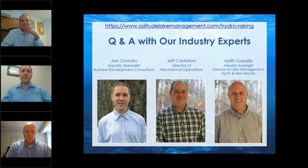So, I think the short answer is probably yes. I think there's a lot of variables. As much as I hate to give a wishy-washy answer, there are a lot of variables at play to really determine whether or not the use of the hydro-rake could have undesirable impacts to the system. So, is the pond truly perched above the water table? How thick is the clay liner? What type of clay liner is it? What are we targeting in terms of removal, aquatic plant species, accumulated organic material? I think all of those things would ultimately determine the final answer as to whether it would be an applicable technique. So I guess I would give it a strong maybe.